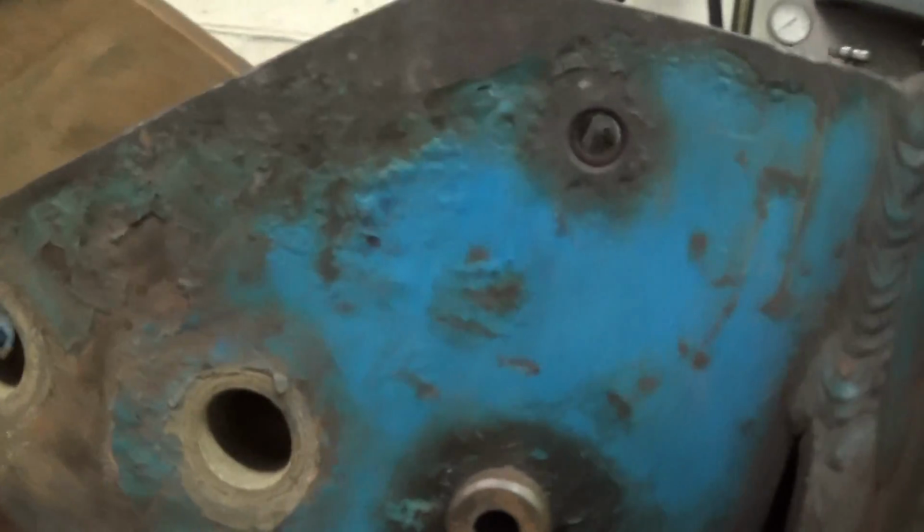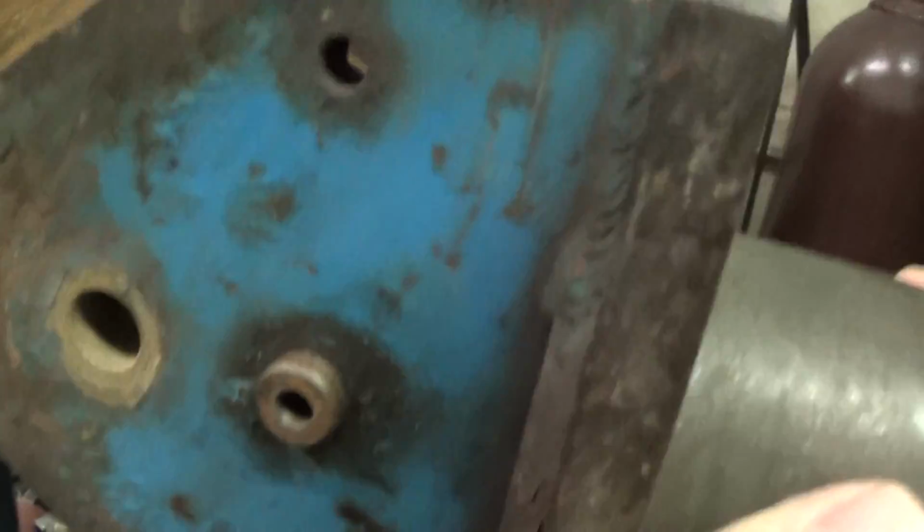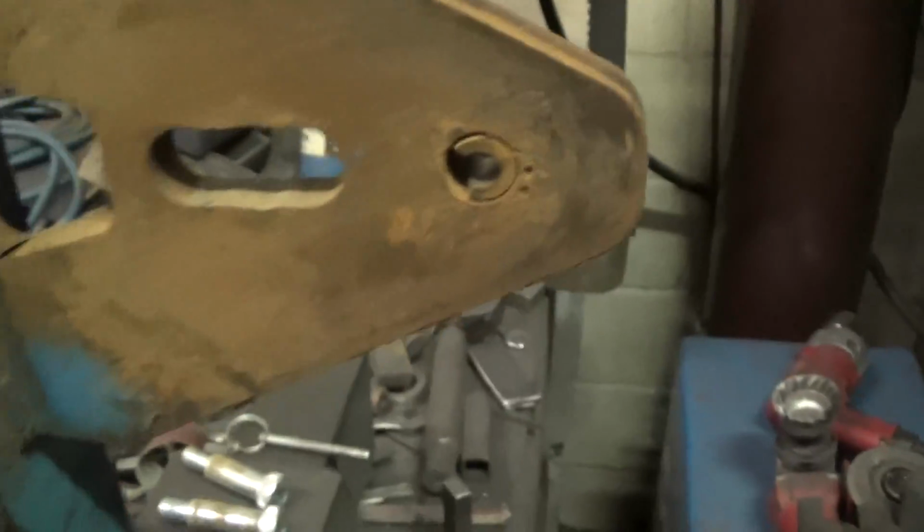Again, I believe what it's designed to do is rely more on the clamping force of these bolts, because the idea being, if that pin there breaks, it'll slide, it'll kick back, and it'll stop right about here, and it'll reveal that you've broken the shear pin, because now you'll have all that daylight up in here. So I guess that's the idea of it.